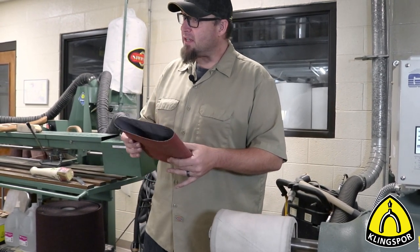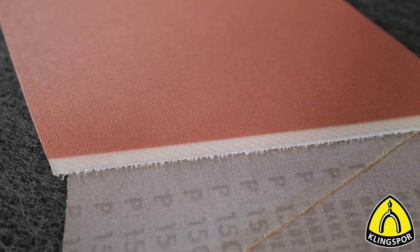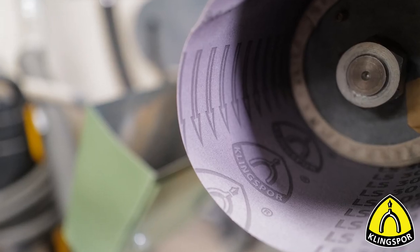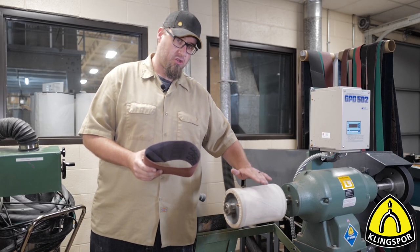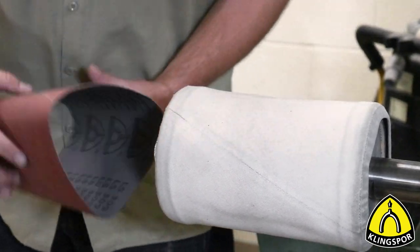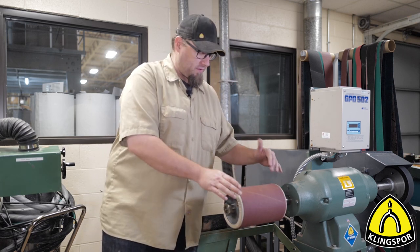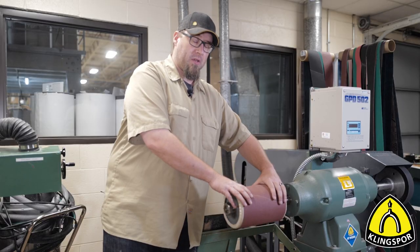What makes the pump sleeve nice is that it's flexible. The joint on it is a very special joint called a number one joint — it has no tape. That means you'll have a perfectly consistent surface area when sanding, but it also means you need to follow the arrows. The arrows are very important — you work with the piece as it comes around. Your pump drum should always have some sort of canvas sock, and sometimes a sweater or sock material on top. You simply slide it on, ensure the arrows are going in the correct direction, and when you inflate with air it holds in place — no adhesives or tapes needed. If you find yourself needing those, the sleeve might not be the right size.